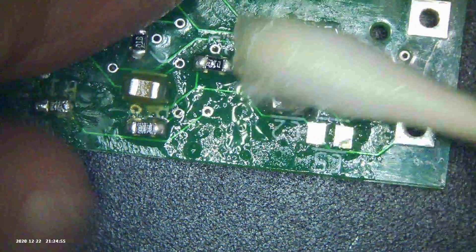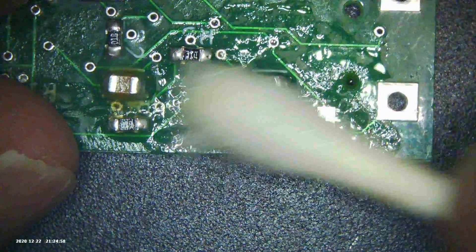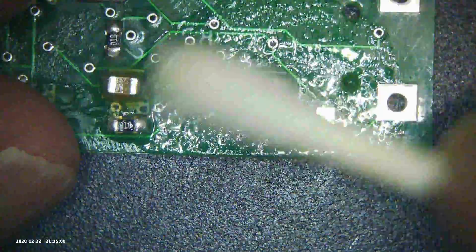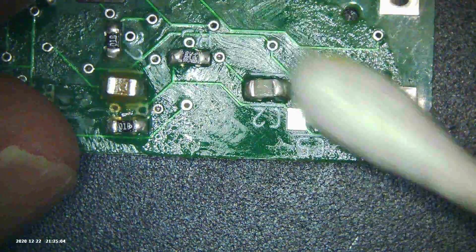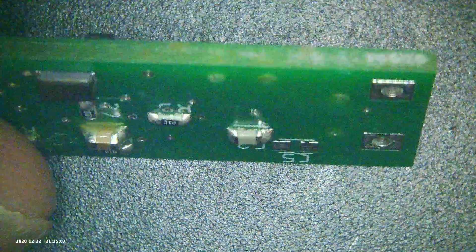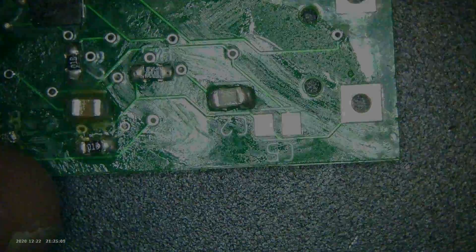You want to clean your board really well. I'm just brushing this off a little bit just to get a side view without a lot of excess flux getting in the way. But you'll go back over this eventually with a toothbrush and give it a good thorough cleaning, wipe off all that flux. I also tried an 0603 resistor — these are the resistors I'm using for the board — and exactly the same technique. These actually feel a little easier to me; the 0805s took me a while to get the hang of, but these seem to go pretty quickly.